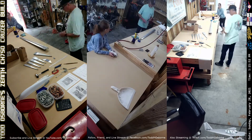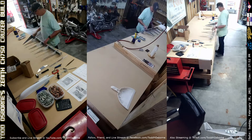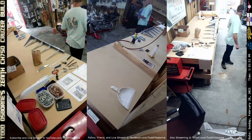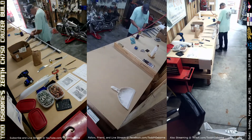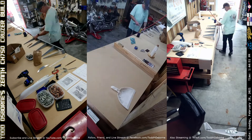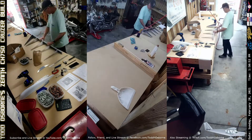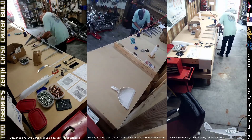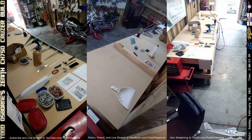If you notice here, I'm putting the hinge on first. This turns out to be a problem. I did it this way thinking that without the ribs in the way I'd have a lot easier time cleaning up overspray from priming, but you can't do it that way. There's just not enough room between the ribs and the hinge to do the hinge first — the ribs have to be completely riveted to the rudder spar first. So here I'm drilling it out — all those A5 rivets, the whole row, had to be drilled out.